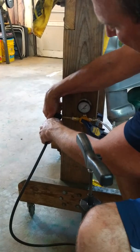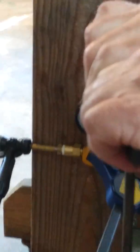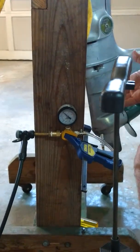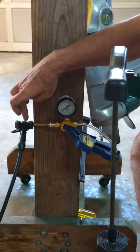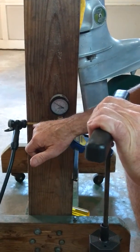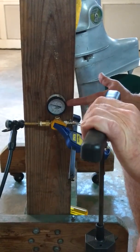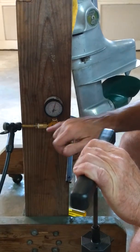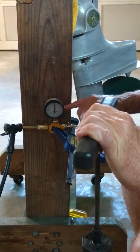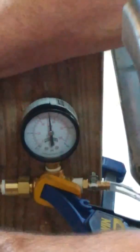If you use an air gun in a shop, you possibly might put 20 or 30 pounds in there. And what will happen is, while this is hooked up, the needle will fall back down — don't let that mislead you, that's only because it's still hooked up. I put in a check valve to slow this process. I first tried it without a check valve, just using the check valve in the stem, and the problem is you got to pressure it up high and by the time you click it off, you're down to three pounds. The nice thing about this check valve is it controls the fall of the needle. So I pressure it up a little high and as she's falling, I let it get between the range and then I pop it off.